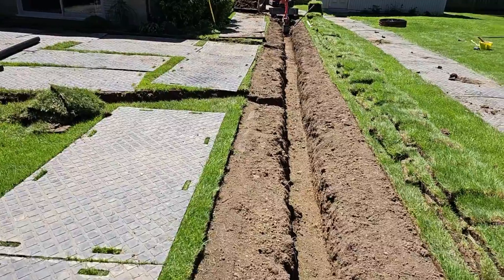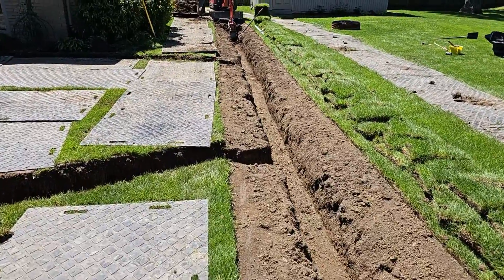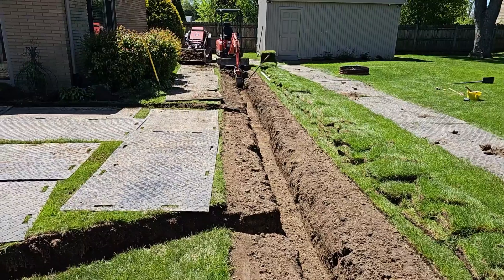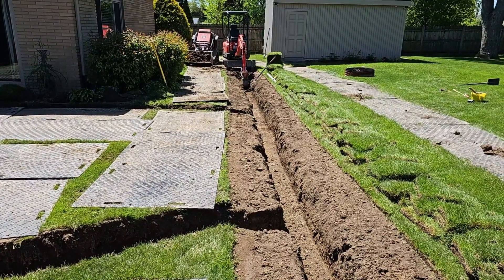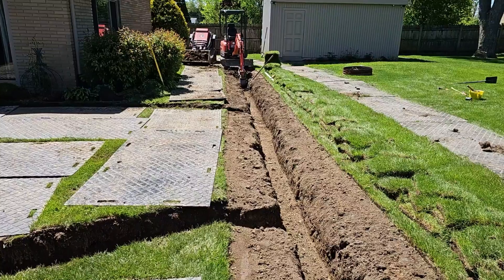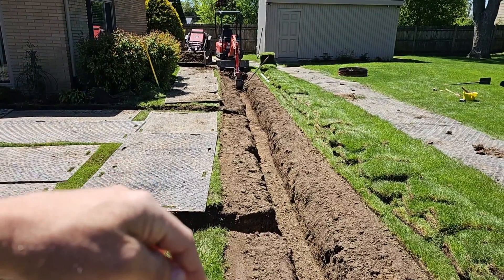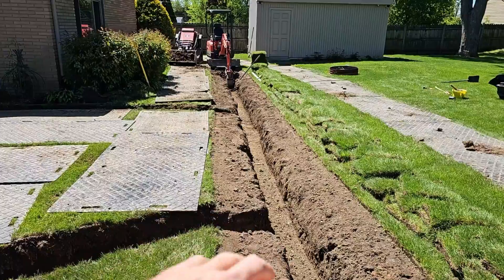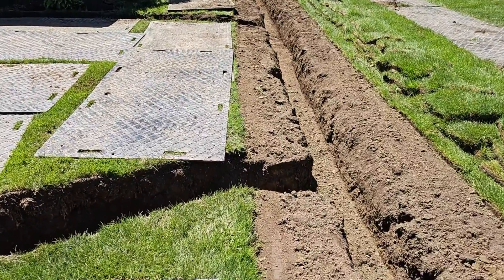You just create a little bit lower elevation — it doesn't have to be exaggerated. You don't want to create a maintenance issue where it's hard to mow the grass. That's just a nice, soft swale — beautifully done. You cut that swale out, you can literally start digging your French drain trench, and have someone shave this down and just ramp it a little bit. Nothing too extreme.